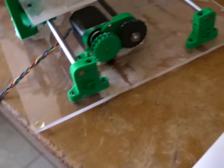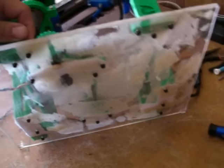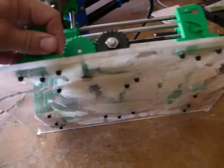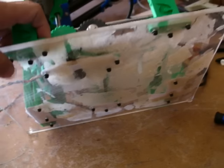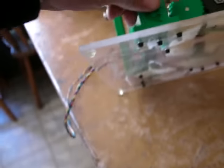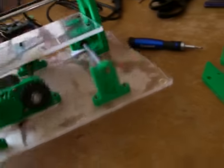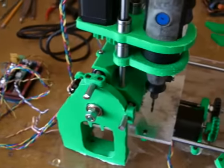Something else I also did — because plexiglass is a stiff material, any noise generated through the milling work or through the stepper motors gets transmitted through the bolts on the bottom to your table or bench. So I put on some rubber feet that I bought from a now-defunct Radio Shack many years ago, and they work absolutely wonderful.